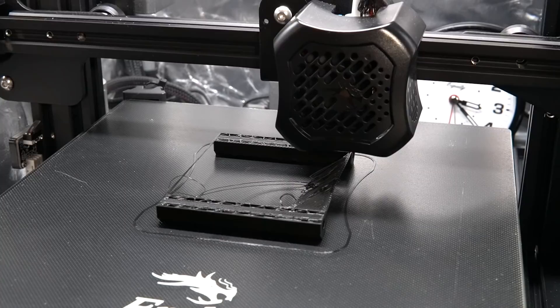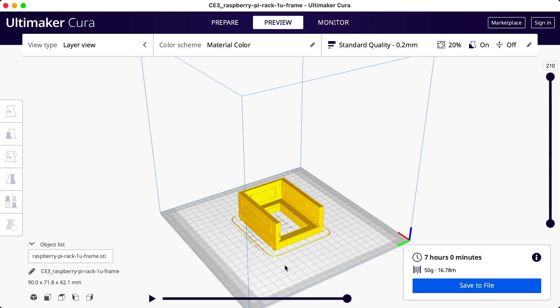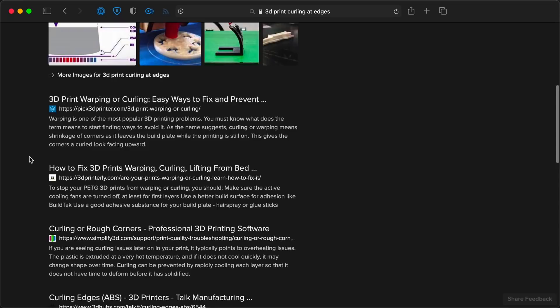Apparently it's a little tougher to build 0.2mm bridges over a 10cm gap than I thought. So I tried turning the print over on another side, and I stopped that print when I realized it was going to try to bridge the gap again in a different place. So I added supports everywhere. The next print went a little better, but the print wound up curling up on the edges. I have a lot to learn about 3D printing.